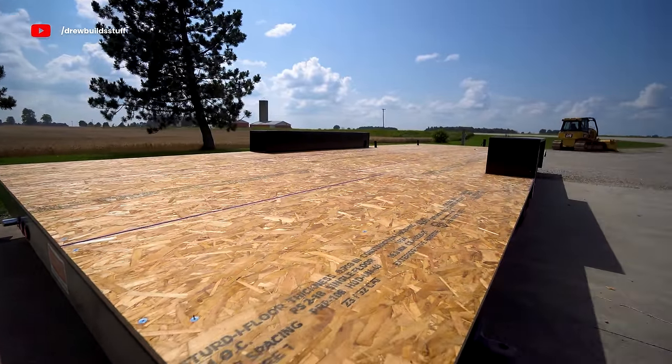To start the gable ends, I'd first measure out the bird box, as well as the vertical portion up to the soffit there. And then I'd transfer this on to just a scrap piece of fascia. I'd also make a mark an inch further so I can bend it around the corner, and make a mark at the 1-inch point. So starting at the 1-inch point, I would just cut off this bent over tab here, and then make a 45 degree miter.